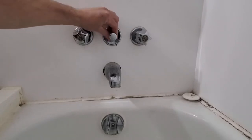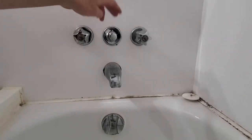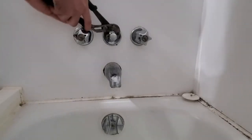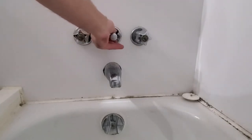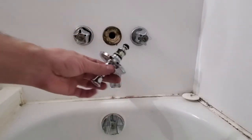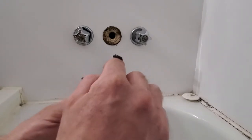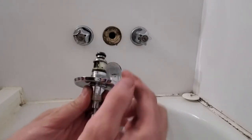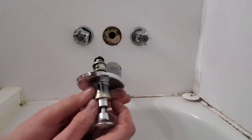I'm gonna show you what I did to fix it. I got a pair of channel locks — you can get the proper wrench, I'm just gonna use this. So we unscrewed it. My diverter valve is this piece here. The o-ring that came off it broke and lodged down into here, behind the plunger, and that's why the valve wouldn't work correctly. So we replaced the o-ring itself.